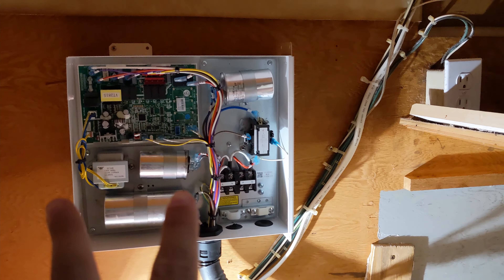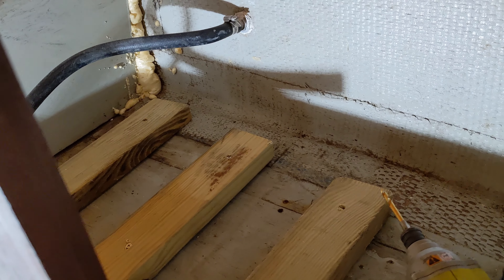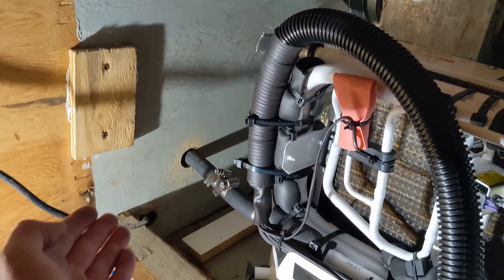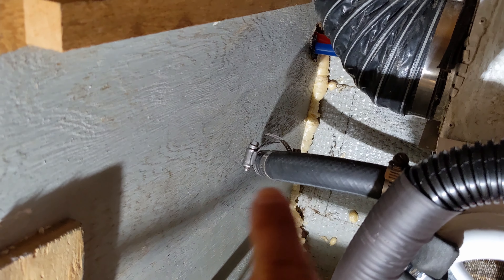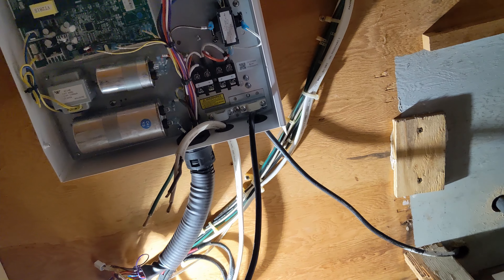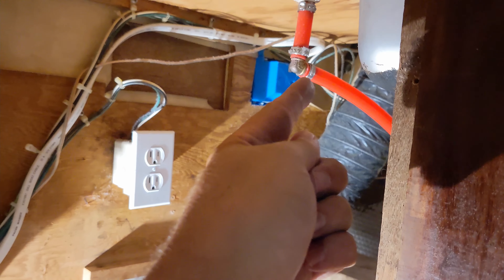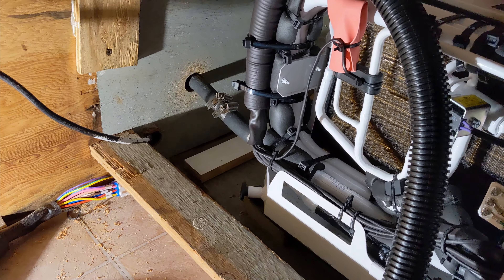The old unit is ripped out. The control box is mounted. Making a new base for the unit to sit on, just kind of placing it right now, and going to get some measurements to see if I have to cut any more of that for the duct work. Making progress. The new unit is in place. I have the seawater inlet connected — I had to drill a new hole for that to line up — and the seawater outlet connected. Now I'm going to terminate the ends for the seawater pump and the main power with some heat shrink connectors. Next up is running the remote control that'll go up near the vent to control the unit, and I've got to get the temperature sensor in place. We're making progress — 3 o'clock in the morning, still going strong.